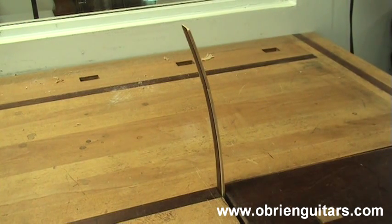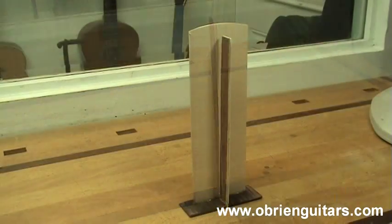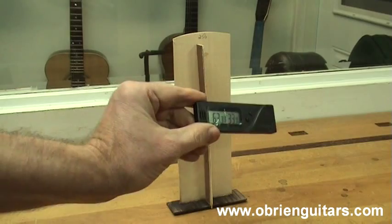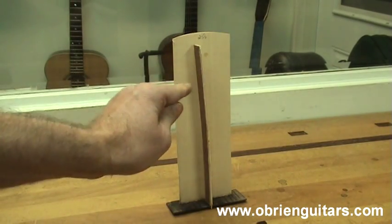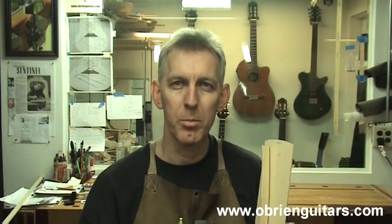As the relative humidity level in your shop starts to drop, then it will swing back the other way. If you wanted to, you could even make yourself a little stand to help hold your hygrometer. If you have a hygrometer in your shop, you can even use that to calibrate your homemade hygrometer by making marks on the stand. So this little tool could become one of the most important tools in your shop — it will help you know if there's a change in relative humidity.